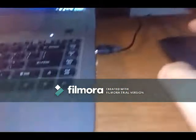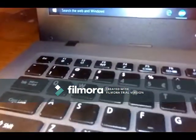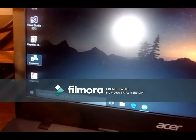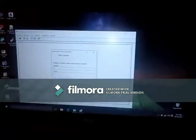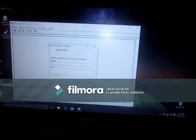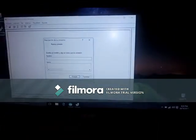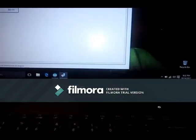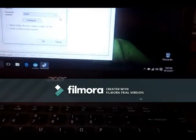All it's going to do is listen to the serial port for any specific characters. In this case I'm using A, B, C, and D capital letters. Any of those letters will have an LED turned on and off. It's a very simple sketch in the Arduino — just listen to the serial port, and if a specific letter or character is typed in and fed into the serial port using the echo command on the router.